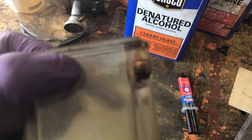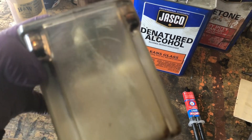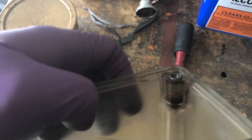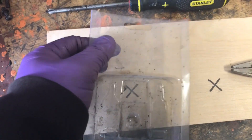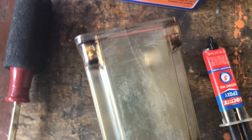In the process of cleaning this, I realized there's a crack right here — you can kind of see it. It goes to about right here, and then there's another one right here that's just started, kind of superficial under the surface. So what I'm going to do is drill a little crack stopper right here with this small drill bit, then fill this line with epoxy. I'm going to cut out a piece of plastic, chemically clean everything to get all the oil off the inside and out, and then do a non-structural repair here just to help keep that crack from propagating.